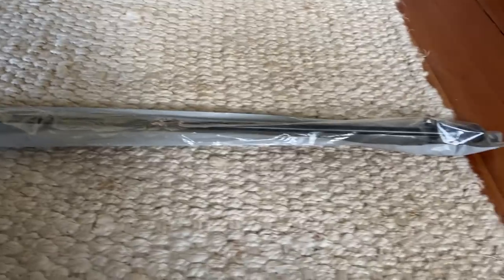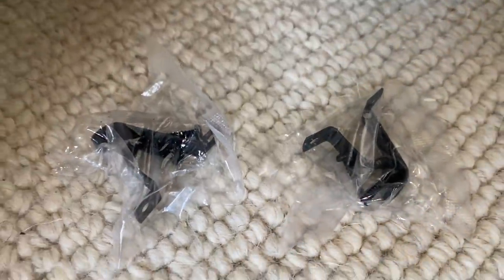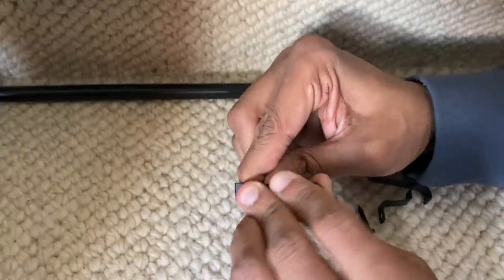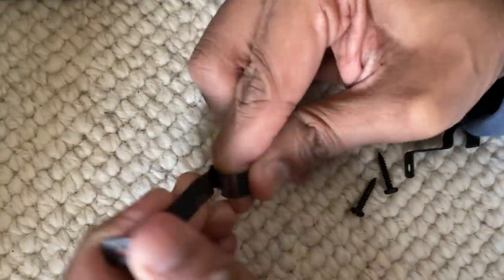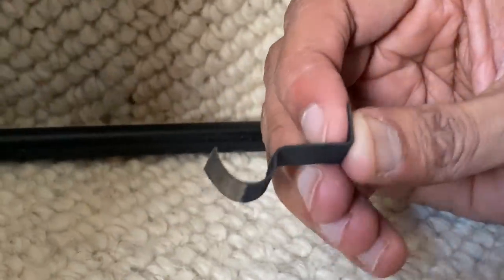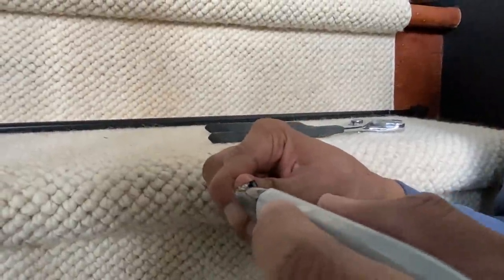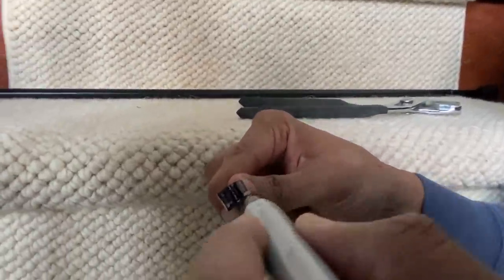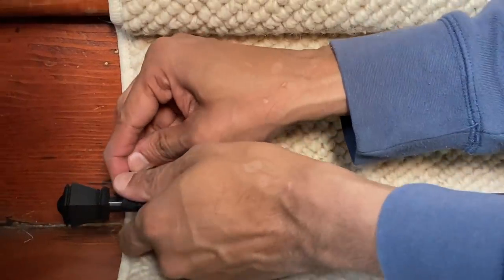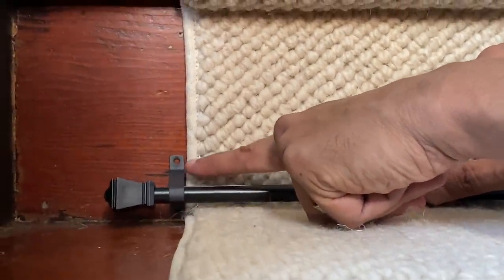There's a small size and a large size and they're expandable — at the smaller size it starts at two feet and can expand to four feet, but for the actual stair I only need about two feet and a couple of inches. The brackets came in the package, but instead of putting two screws in we wanted to eliminate that to one. By bending the metal back and forth it will break since it's quite thin, so we used pliers to go ahead and cut them. When we broke them off we noticed the inside of the bracket wasn't matte black, so we used a small Sharpie to quickly even out the color.